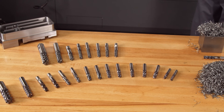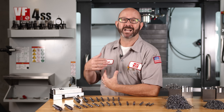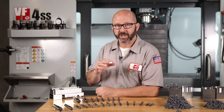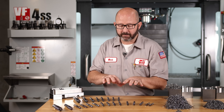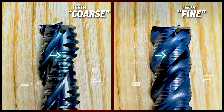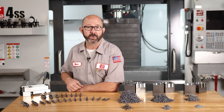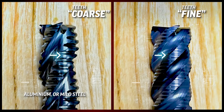The same rougher made out of solid carbide will cost more than its cobalt cousin, but it may be able to run at 10 times the speed, which can help us reduce cycle times. Beyond material types — cobalt versus carbide — these roughers are available with fine or rough teeth. In general, the harder the material we're working with, the smaller the teeth, the smaller the serrations we will choose. If we're working with a mild steel or aluminum, we'll choose a coarse tooth. If we're working with hardened steels or a super alloy, we're probably going to go with a smaller tooth, a smaller serration.